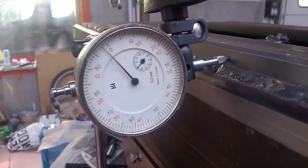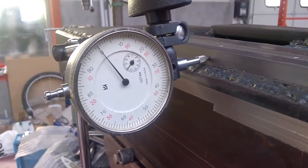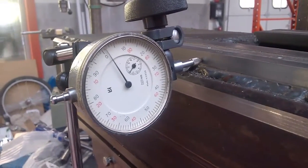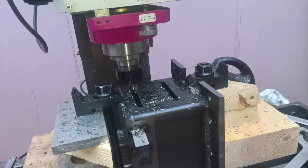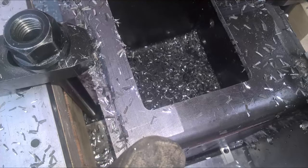As a bonus, here's a quick video of the CNC lathe running quite well — until the two-thirds mark, where needle movement is less than one thousandth, but in the last 50 millimeters it goes from about one thousandth to almost four thousandths, so the tool deflected quite a bit. Here you can also see a few pictures of the headstock machining.